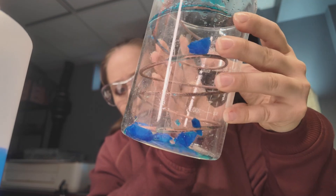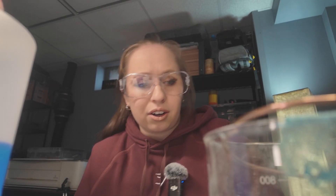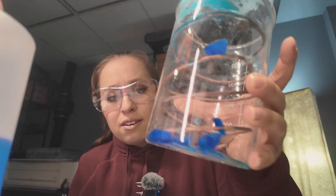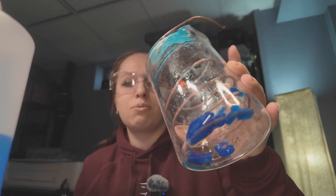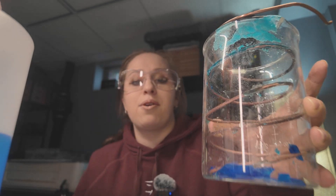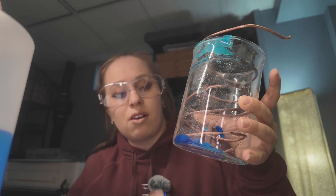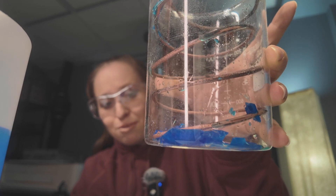You can see there are a couple of blue crystals. You can dissolve these in some distilled water. I got these blue crystals because there was a lot of evaporation so they precipitated out of the solution — this is just copper sulfate. What I'm going to do is slightly crush them up and throw them back in the bottle for now, and when I go to use my solution I'll dissolve them then. This one actually grew around the anode, so again this is why you don't want to leave your anode sitting like that. I'm just using a chopstick to break that off the anode.